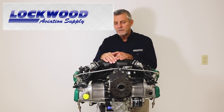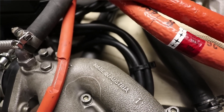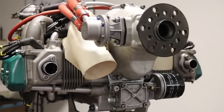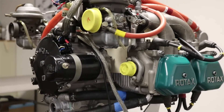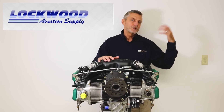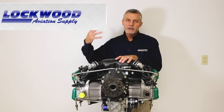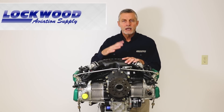On the injected engine, there are two different coils on the stator, and a box called the fuse box that comes with the engine has two regulator rectifiers. That fuse box can use either regulator to power the engine management system, or EMS. Normally it uses regulator A for EMS. If regulator A fails, it switches to regulator B. Normally regulator B runs the airplane — charges the battery, runs the radios and appliances. If the fuse box needs regulator B to run EMS, all your aircraft systems run on battery power alone. How long that lasts depends on battery capacity and how well you shed the load.